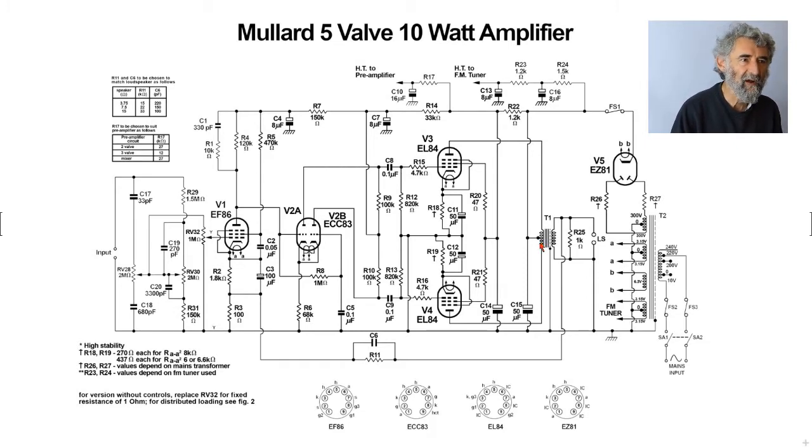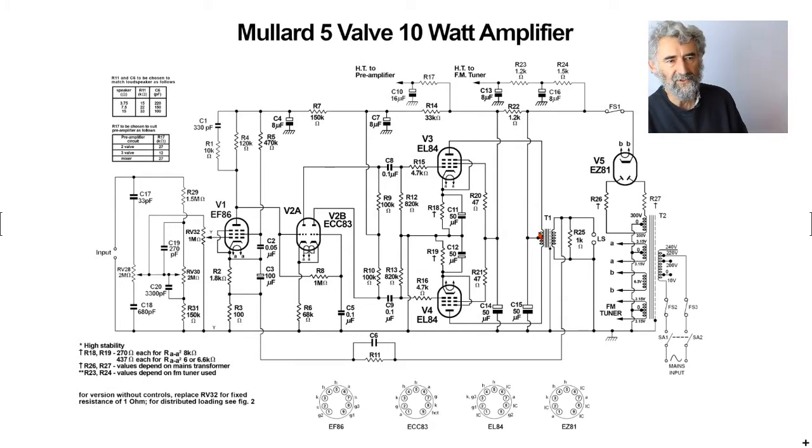This is a push-pull amplifier, as I hope by now you can see. So you have got 3 1/3 times the power of the previous amplifier. Frankly, in acoustic terms, that isn't really a very big change. You do, however, get the cancellation of even harmonics, as has previously been explained in theory, by using push-pull. They are cancelled in the output transformer.